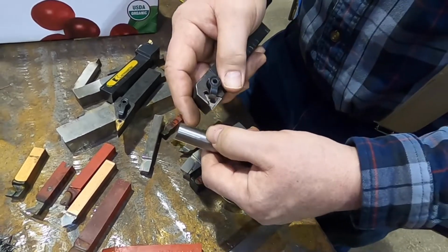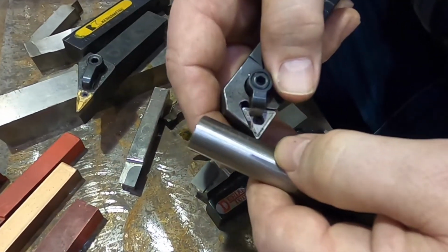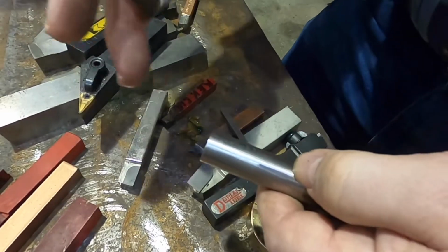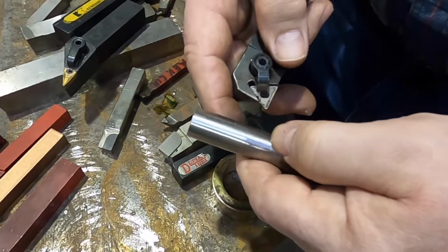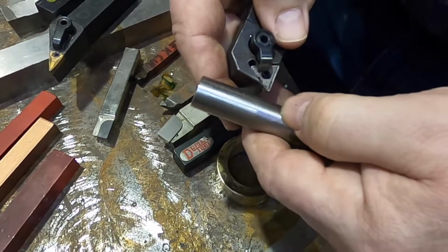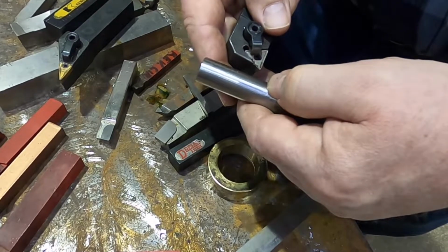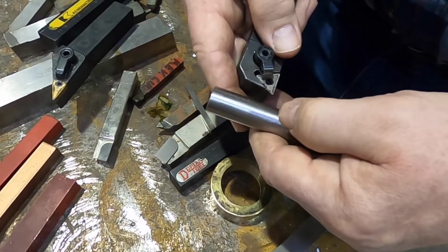So now in this case, if we have something that's an example of that, you have minimum cutting force, so you go to your smallest radius, you're cutting along here, but the shoulder still wants, because after this it's got something that needs a lot of strength, so it wants a big shoulder, big radius in the shoulder. So now we have to actually form the movement to make the shoulder. Which is common to be done on lathes. It's done on manual lathes as well as on CNCs. A CNC or a tracer will make a nicer radius.